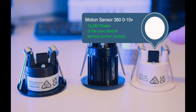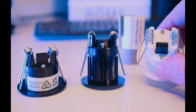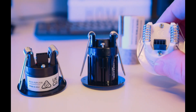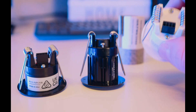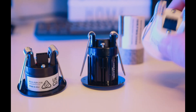Finally we've got the 0 to 10 volt version. It's powered slightly differently and gives you feedback on both the lux level of the light input into the sensor and motion as well. So it gives two communications back to your home automation system — super useful for environments where you want triggers to be specifically based on whether it's dark or light.